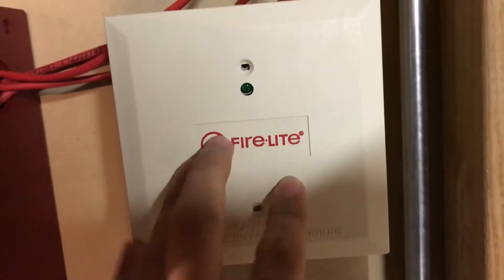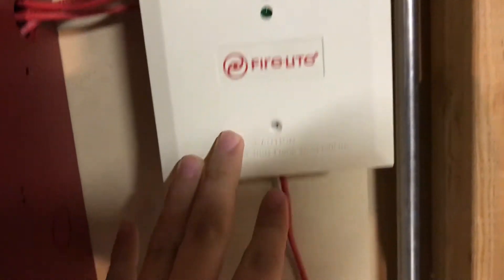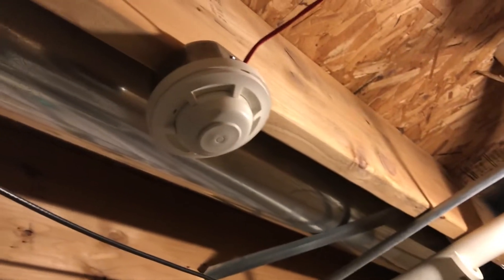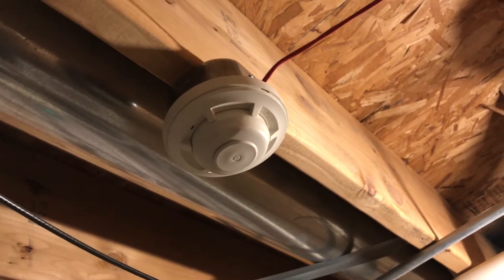Got some test smoke here. Over here we have a control module that is hooked up to nothing, a BG-8. We'll go this way first. Follow this wire — I don't have actual cable hooks yet, so I'm just using tape, which is unfortunate. We have a conventional heat detector, which could spring up and activate the mini-mod behind it.